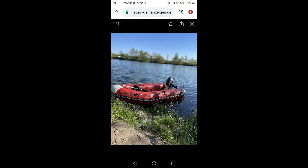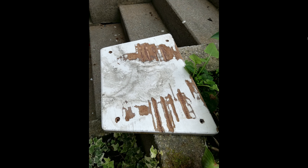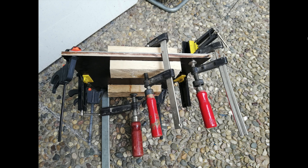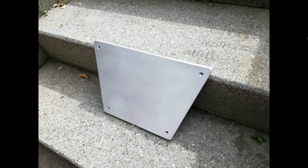We also want to transport a boat, so let's get back to the boat. I bought a boat from eBay — it was completely damaged, that's why I could afford it. What we did was glue back the transom, but it wasn't just gluing; there was a lot of sanding and removing the old glue. The back plate and inner plate were also in bad shape. First I made a new back plate for the transom — I glued some aluminum with wood, and after a little filing and making new holes it looked much better.